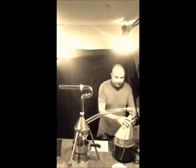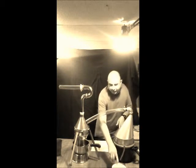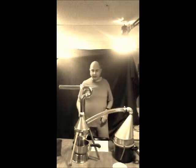Now, steam is going to condense and flow out of this in three different areas. The first area is the top hat. Steam condenses here, and inside of this top hat, we have an inclined rim that catches the water as it comes down, and it flows out this spout, and then you have a condensation catcher there.